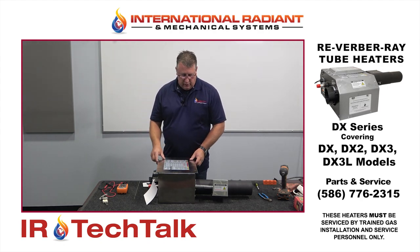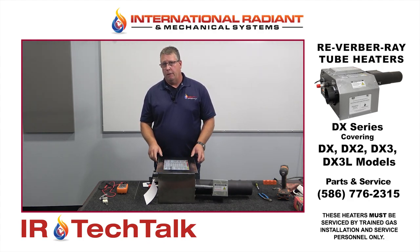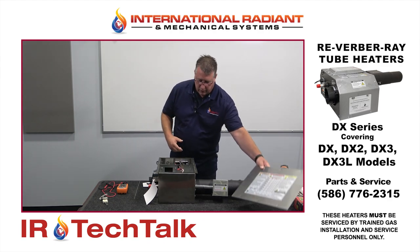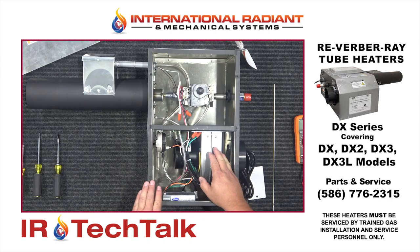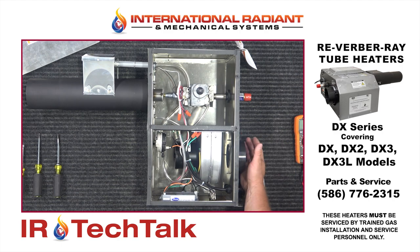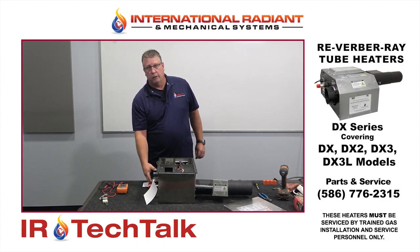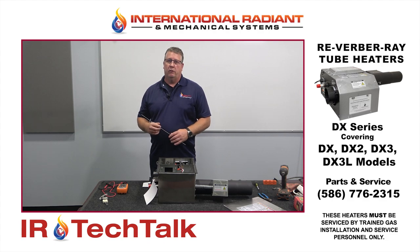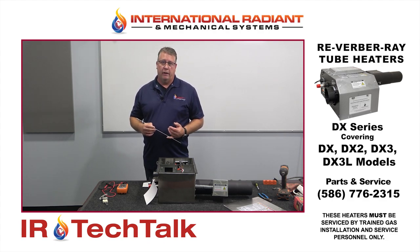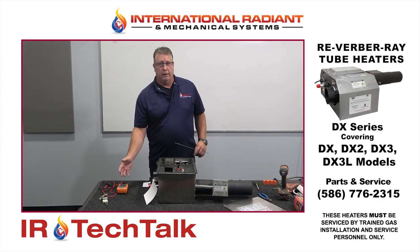One very important thing to note — we get a lot of calls on troubleshooting where they want to diagnose whether it's a bad fan blower or a bad pressure switch. But sometimes there are external variables to the heater. For example, blockage on the inlet: this is an air intake collar, and in dirtier environments you would actually have fresh air pipe hooking up to this collar, so you do want to check all the way back for bird's nest, dust, or any type of debris that might be in the intake pipe.